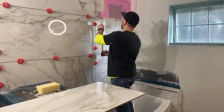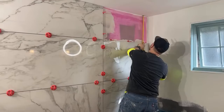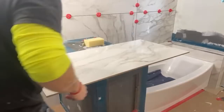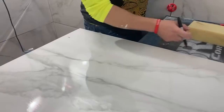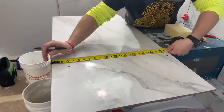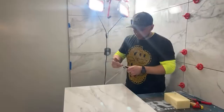All right, this is 18.58. Aaron, that's an awesome goal. Sorry, Aaron, one second. So this side is 18.58. See, so this cut, I have to cut it on an angle by 1/8 of an inch, a little bit less. And on that tile saw, it's going to be sick. So 18.58 plus, because I want the 1/16 inch taller on that side because the wall kind of runs away a little bit. So it's so easy with that saw to adjust the tile, boom, cut it.